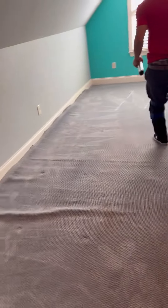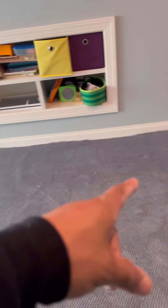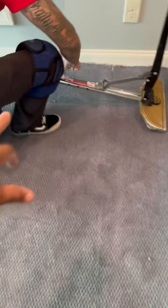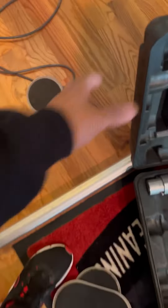We're gonna start this way right here, and then start left. You see how this wall's a little angled right there? We want to stay away from the weird walls as much as we can. Get this connected here and put it over here. That's how you set it up. That's the head of the stretcher. That's the extension pole. And these are our stretcher poles. We also have an extender pole whenever we stretch bigger rooms.